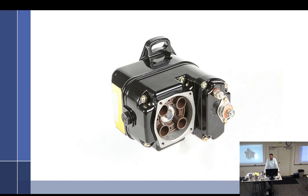So what's the advantage of having the Surefly over just the mags? There are a lot of advantages. Number one, these magnetos right here require a 500-hour inspection. It is a few parts short of an overhaul. Slick magnetos, you might as well just throw them away at 500 and buy a new one, or just send mine back, get new ones, and put them on. So they're only good for 500 hours, and then they need an overhaul when the engine needs overhaul. Basically you can figure every 500 hours you're just overhauling them.